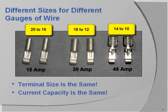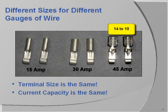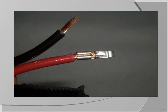The terminals can be soldered or crimped. While you may think that soldering provides a better connection, you should know that the FAA requires wire harnesses on aircraft to be crimped, not soldered. That's because solder joints become brittle and wicking causes solder to break. A properly crimped terminal forms a hermetic weld between the wire strands and terminal.